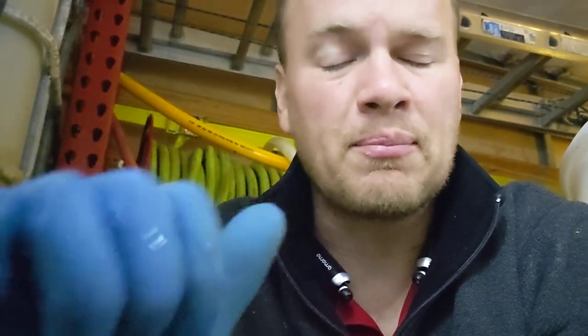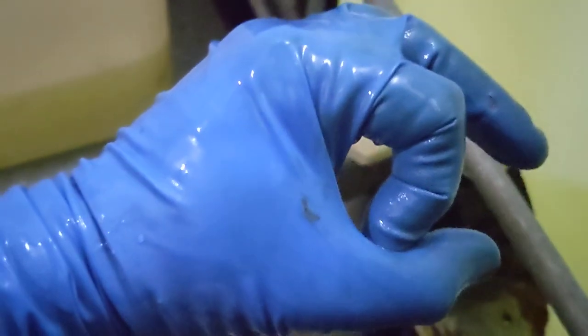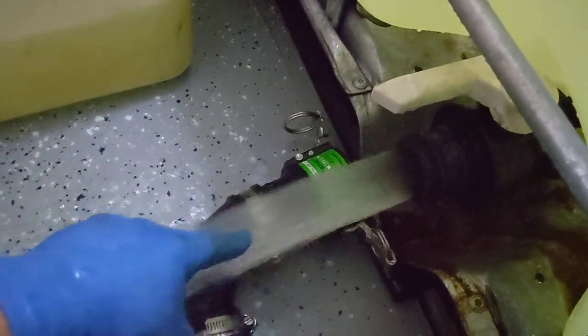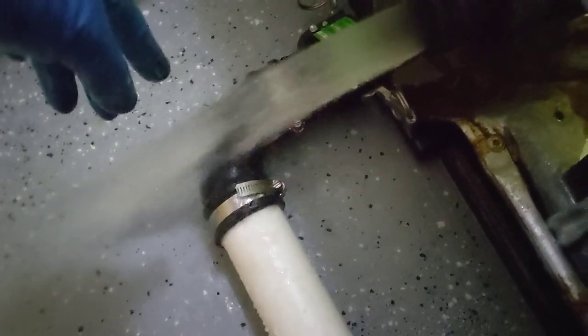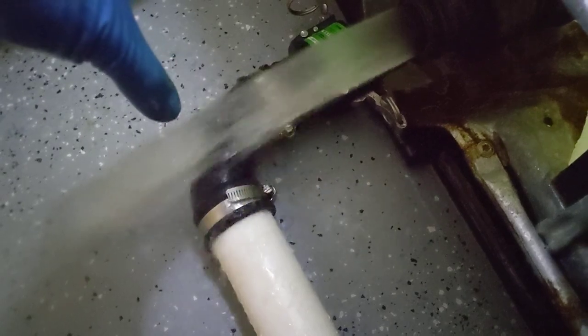I hope that helps. The tank has put out a whole lot of pressure, a whole lot of flow. You just have to properly plumb things so that you take advantage of that, instead of taking it to some teeny tiny half inch supply or three quarter inch. You want to go through that two inch pipe, just like what we've got here — still provides lots of flow, and obviously channels it, so there is some friction in it.